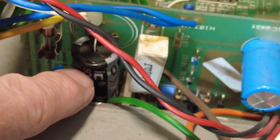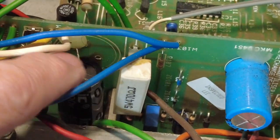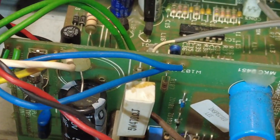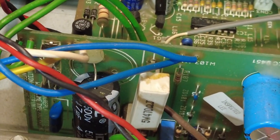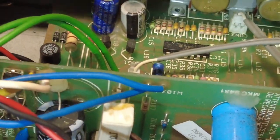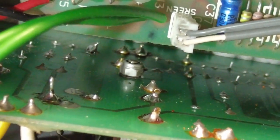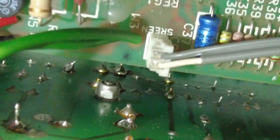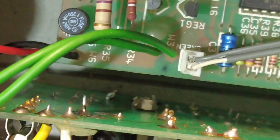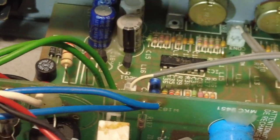If we're just looking there, you probably can't tell, but that doesn't look like factory soldering to me. So I think this capacitor has been changed down here. In fact, it has, because if you look, you can see a circle where a can cap used to be. Now it's got this axial in there, which is a bit loose because it's got no silicone around it, which is a bit naughty on guitar amps, because they're carried around constantly. And you can see whoever's put that in has not bothered to clip off the leads. Nothing serious, there's a bit of a solder extravaganza at the other end. Nothing serious, but it's just untidy. But other than that, we'll probably get a blob of silicone on there. And these caps are obviously original.